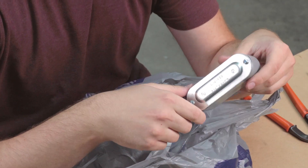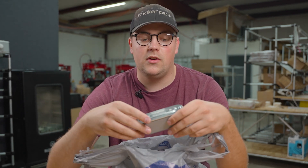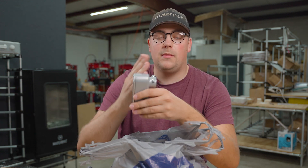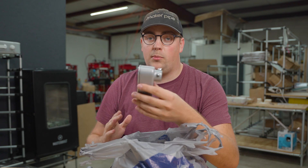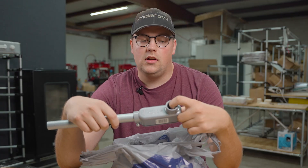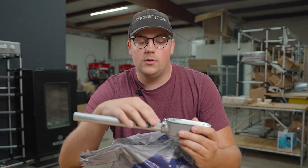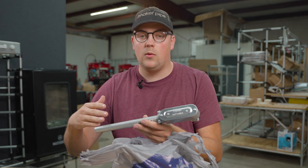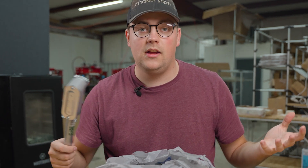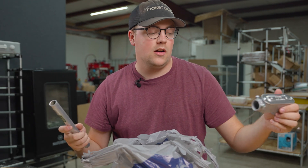First is this pull-through box. When I first saw this, I thought it was like an access panel, but it's actually meant to be, as the name suggests, a pull-through box for cables whenever you're running wires. Imagine if you had a sharp 90-degree corner that you were trying to run cables through — if you're five feet away from where the wires would be going through this corner, it'd be really difficult to push the wires through. It has an inlet for the conduit and another place for the other side, plus two set screws that cinch down on the pipe. Basically, when running wires and you reach this point, you take off the access panel, the wires come out, and you can maneuver them to achieve that 90-degree corner. It just makes it easier to pull through cables in a tight corner — a specialty use case, but it makes sense.